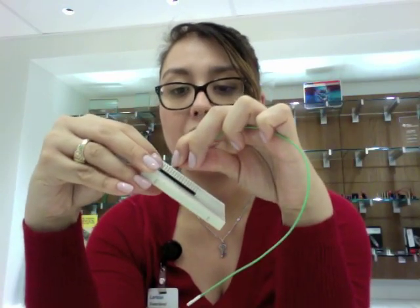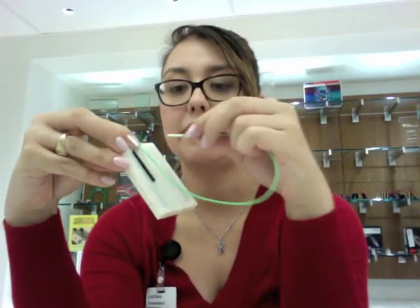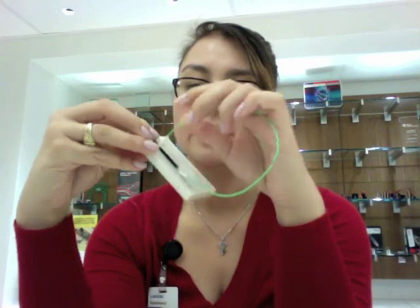The other workaround is using breakaway headers. You can actually adapt a breadboard by putting the headers directly onto it, and then use a female wire to go over to the LaunchPad, plugging it in right here. The best ones for this particular use are actually extended headers — they're a little bit longer, so they'll go the full six millimeters into the breadboard and still have plenty of pin left for you to put the female wire on.